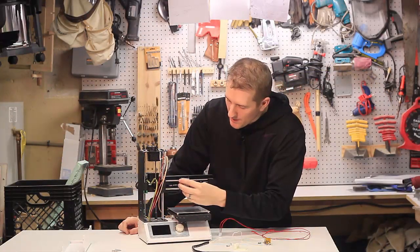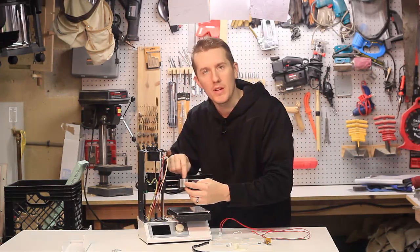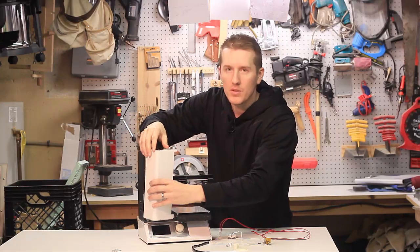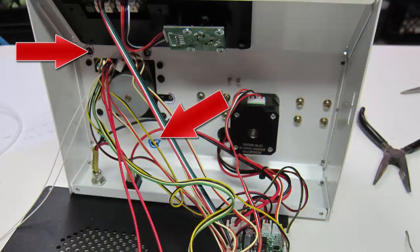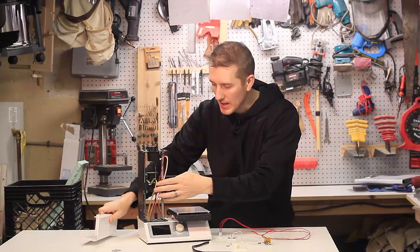You're left with this heat sink on there, and you can look down and see there's a couple of nuts in there. The way to get it is you have to take both cover plates off. There are three screws on the front and three screws on the bottom — same for the back and the front. You take both of these off and you can get to everything.